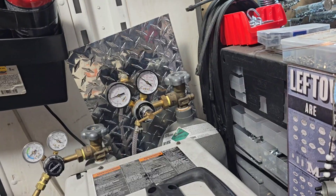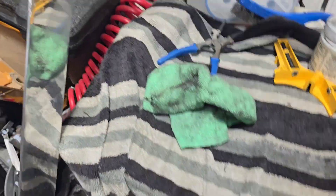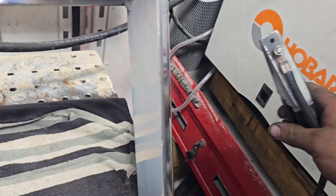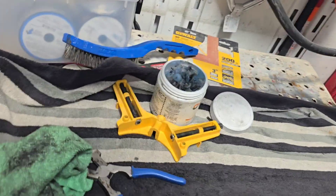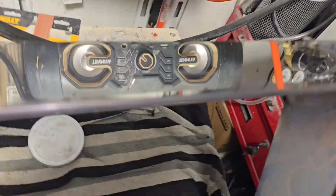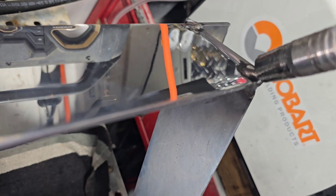Spool gun, just to kick out some argon. 25 — look at that, that'll work. For the spool gun you obviously want your ground. Use your wire pliers — always snip it before you weld it. You got your nozzle grease, this stuff makes all the difference in the world, because so many times the splatter will block this up. Got welding helmet of course. You go forward with this instead of backwards — this is the way the air works.